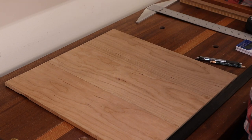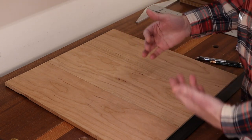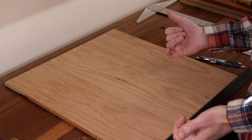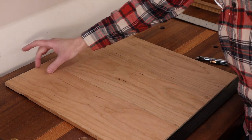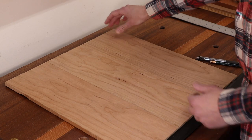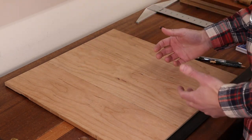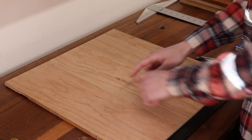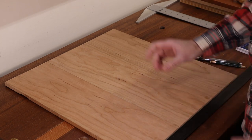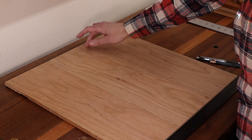That is nevertheless a practical one. If you make the difference in graduations between the height of your drawers a larger one, you can overdo it at some point. You'll get to the point where you have a very, very blade-thin drawer at the top. That's not very practical. And you might end up in a situation where your biggest drawer at the bottom is too tall to be practical and is almost square in shape.